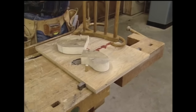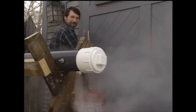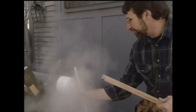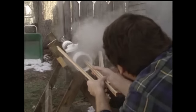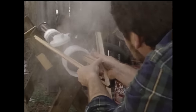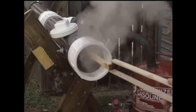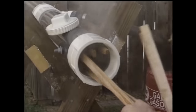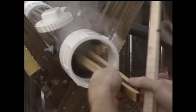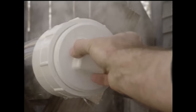Now I think we're ready to bend some oak. We've got a good head of steam up now. What I want to do is just slide the pieces in right on top of my rack. You don't want to stick your hands in the steamer — that's why I have this little set of tongs, you get burned very easily. Just slide these in and we'll seal it up. Let it cook for about 20 minutes or so.